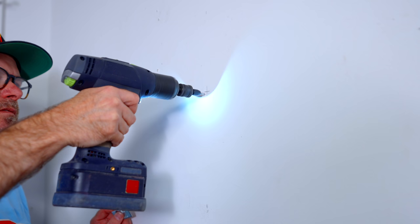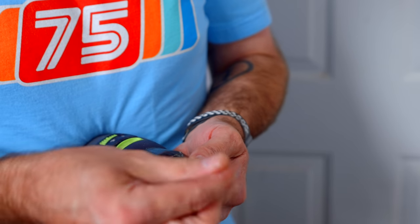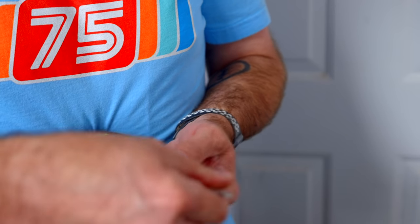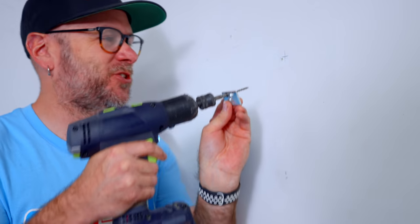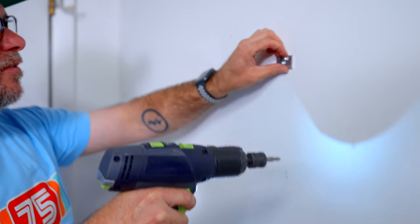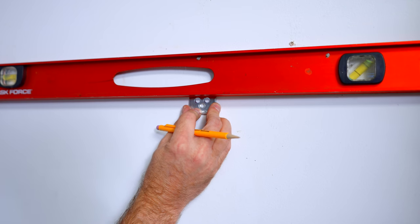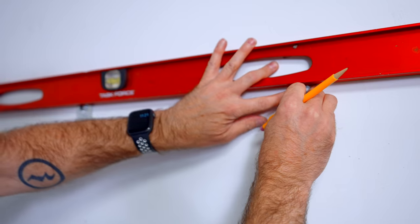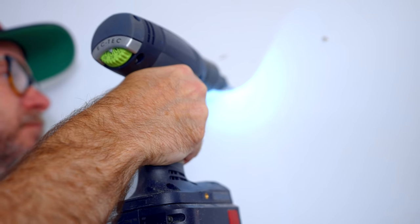Drill one and a half inches deep. This quick change is from Make It Snappy Tools — hashtag not sponsored, but it comes out real easy and pops into place. I've got a one and a half inch screw on there; always get it started before screwing into the wall. Lightly screw it into place so that it still moves but holds. Now I'm going to go 16 inches over to the other stud, use a level to level the two, mark one hole, and drill that in. Now we've got those two in there and they are level, so we can tighten the first two screws and then drill a pilot hole for the third and fourth and fasten them down.